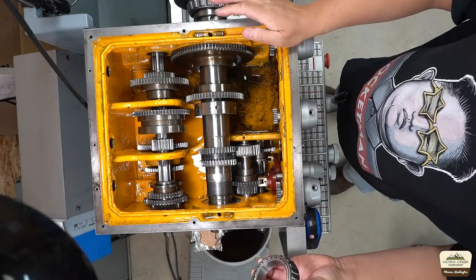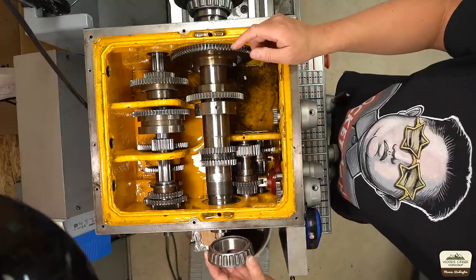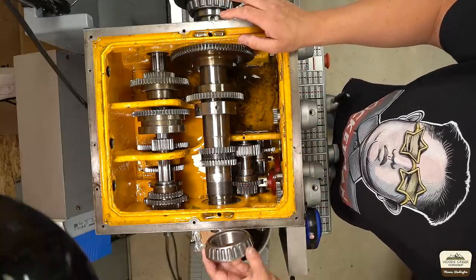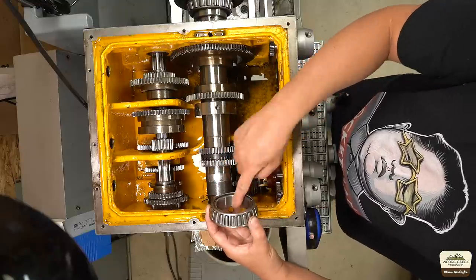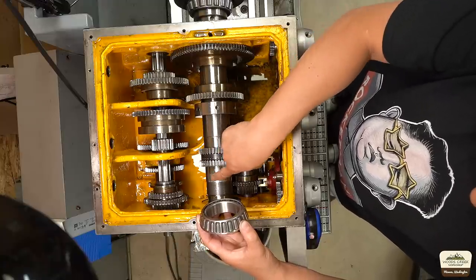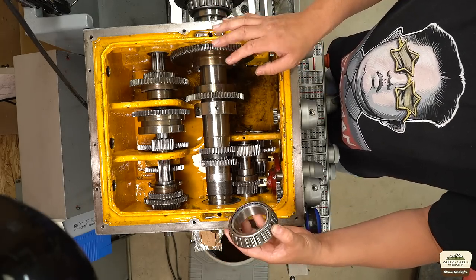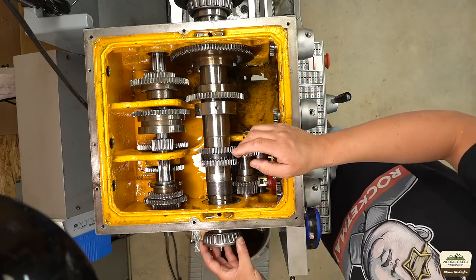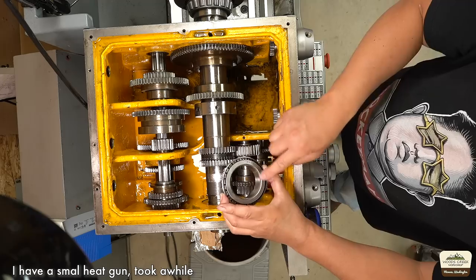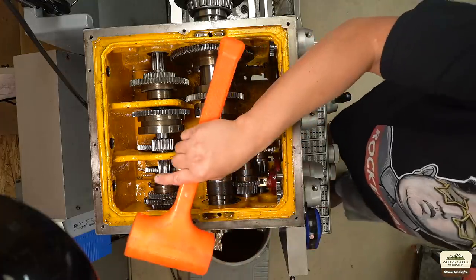Welcome back. I finally got the spindle loose. This is the taper roller bearing at the end of the spindle — the chuck is on the right headstock side, and this is the far end. This fit on the spindle was pretty darn tight — I don't know if it's a press fit but it sure felt like it. I tapped with a mallet and everything, and that didn't work. What finally worked is I took a heat gun and heated the inner race for maybe a good 10 minutes. It expanded enough where I could hit the spindle with one of these soft mallets.